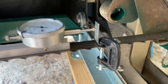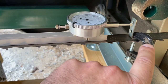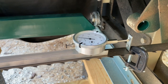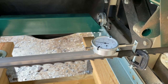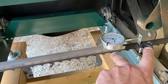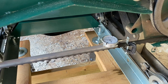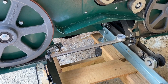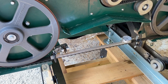Over on the other end I have a little angle bracket, also clamped to the blade, and the dial indicator is just pushing up against that. When I clamped the bracket down, I preloaded the dial indicator by compressing it about three-eighths of an inch. So when we start stretching the blade, that dial indicator is going to extend as the distance increases, and we'll be able to measure that pretty accurately. I've done a few tests to judge repeatability and found it to be surprisingly good — getting the same readings every time.